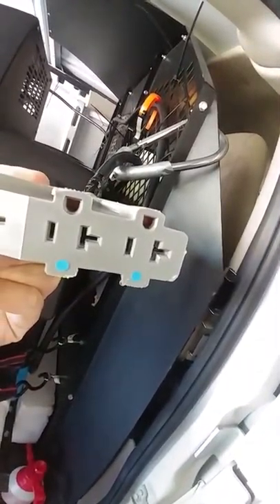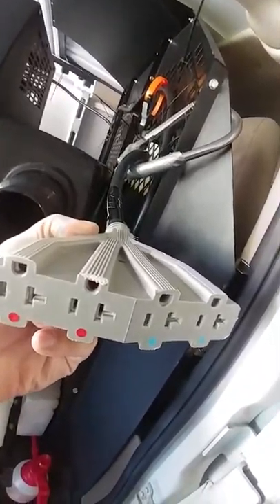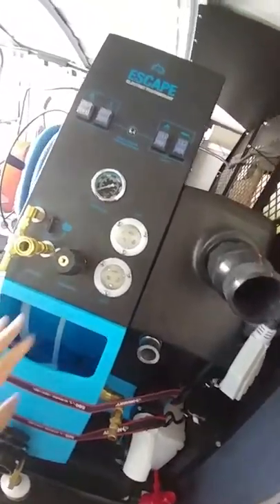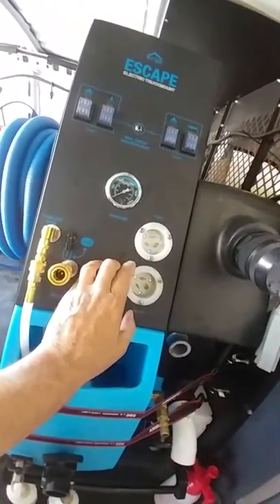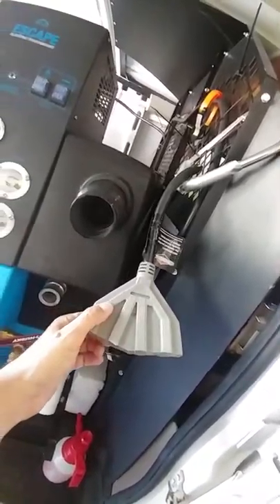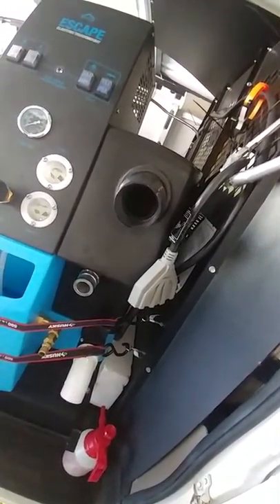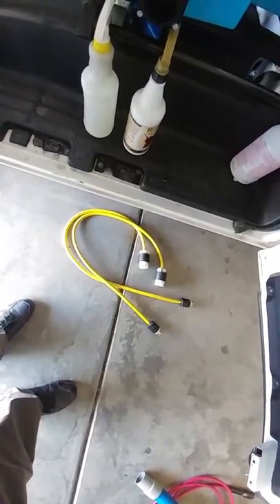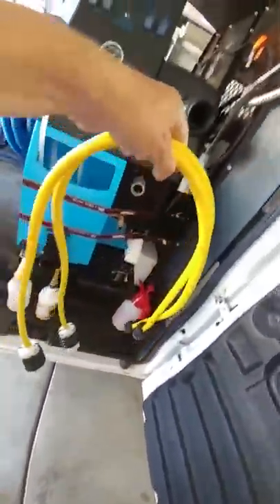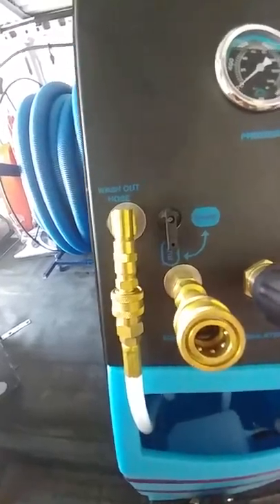This is the other end right here — there are four plugs, two color-coded red and two color-coded blue. That way I plug one plug into a red and one plug into a blue, so I'm drawing power equally from both sides of the generator. The machine gives you two 50-foot cords in 12-gauge wire, but if I'm running from the generator I'd be using a cord that's at least 15 feet or more plus 50 feet — unnecessary. So I made my own cords. This is 10-gauge wire.